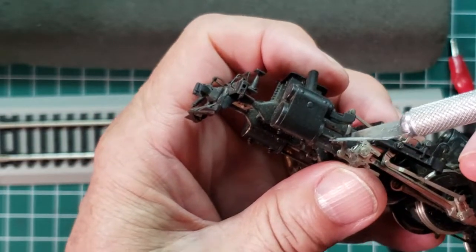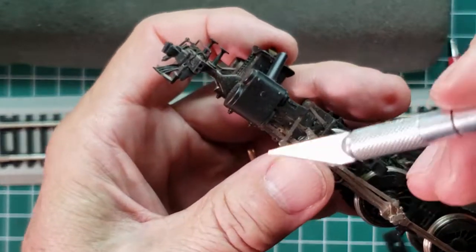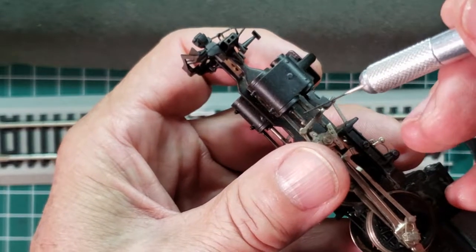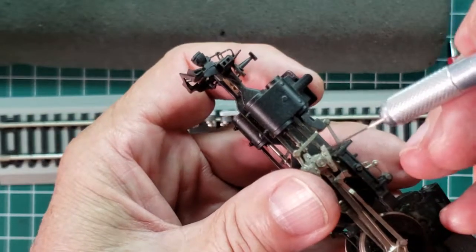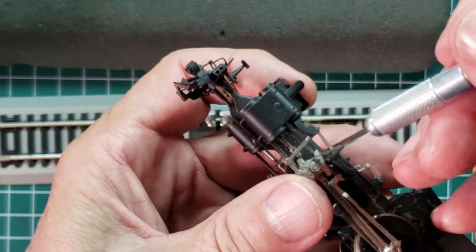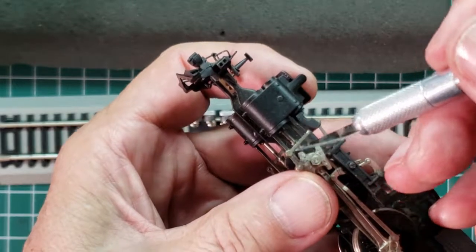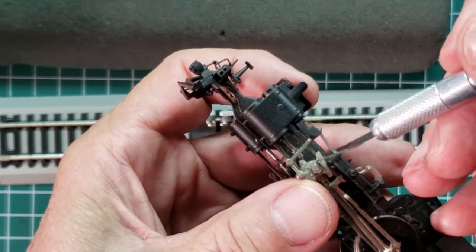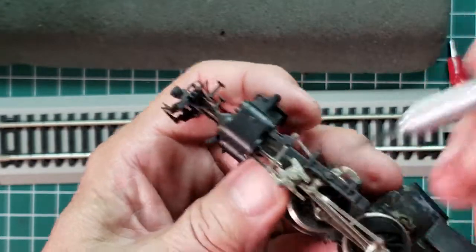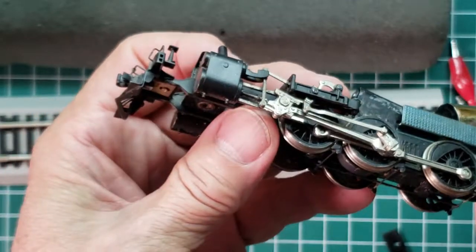And then this, which is the piston, right, needs to be that piston rod. I don't know if you can see it there. Let's turn it around where I can point to it. This piston rod right here needs to be connected to the, call it the alligator, I'm not quite sure, the slider. Okay, so this is the piston rod, needs to be connected to the slider, goes back and forth, and that's creating this issue and this binding in this locomotive. So let me work on that.